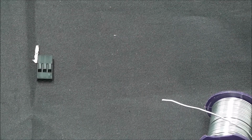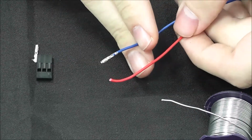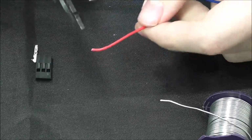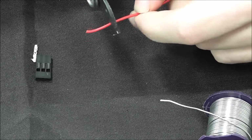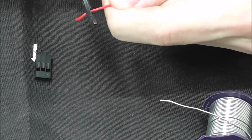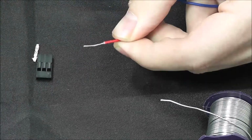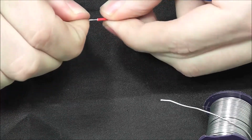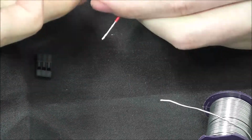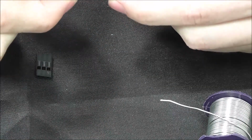and do the Molex connecting side, where we are going to strip the wires, crimp the pins on them, and then stick them in the connector. So I've already done one of them, but we'll go over here and we'll strip this wire. Alright, twist it off to make sure that it's going to slide in the connector easily. Then you'll have these little crimping pieces in your set, and these are what are going to snap into the Molex connector.